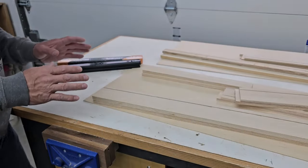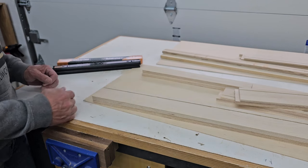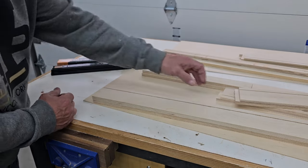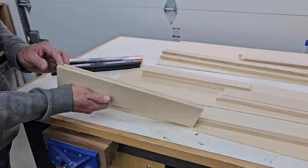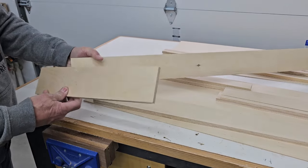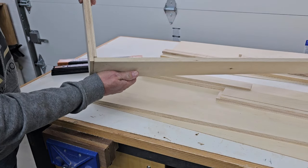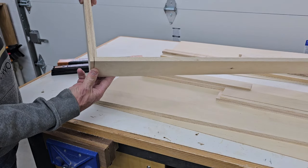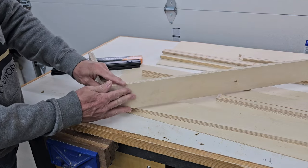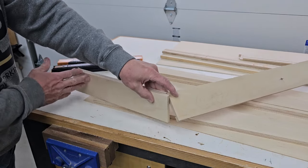So I just finished cutting the wood for the drawers that I want to put in the miter saw table. These are fairly wide. They're about 4 feet wide and maybe 14 inches deep. And I like to cut my drawers where I put a little notch in them like that. So when I match up these pieces, I can do this with a 4-foot piece. There we go. I get a nice clean fit right there in the corner. And then when I put a face on this, you don't see that edge. And on the side, you see nice clean sides.